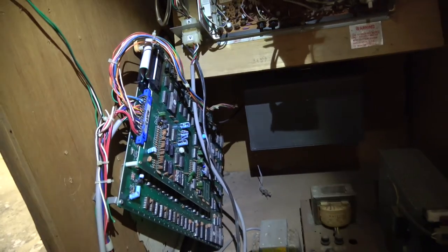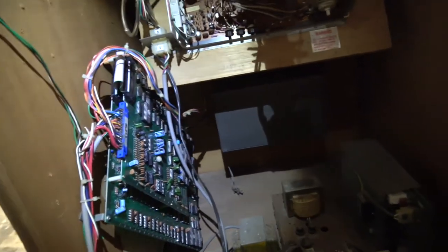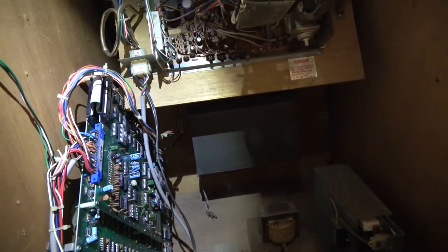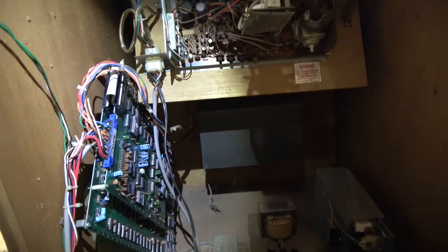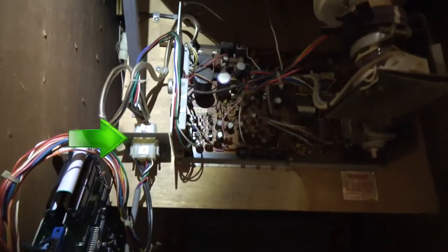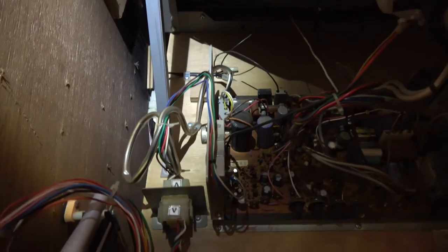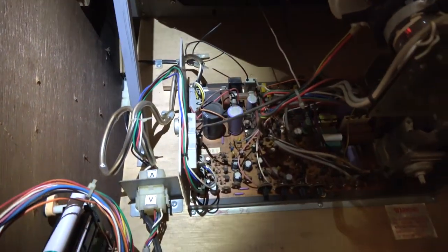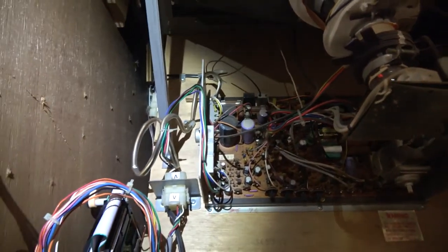I ended up reflowing the sync cable onto there, but that cable harness really needs to be redone. I cleaned the edge connector with an eraser — it looked a little bit crusty on the plus five volts so I don't know if there's a bit of resistance somewhere there. The main Molex connector doesn't quite fit snugly all the way in, but it is together — I did reseat that but it didn't make any change.